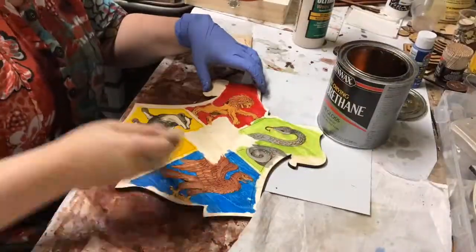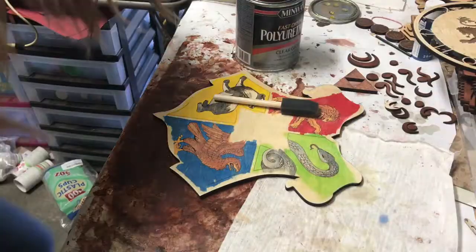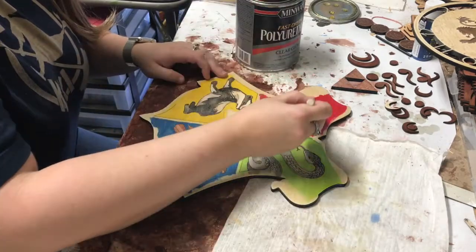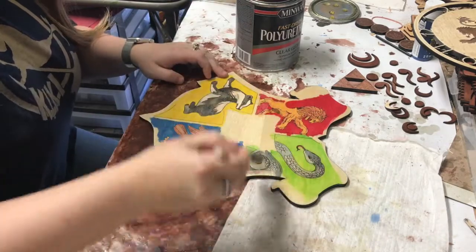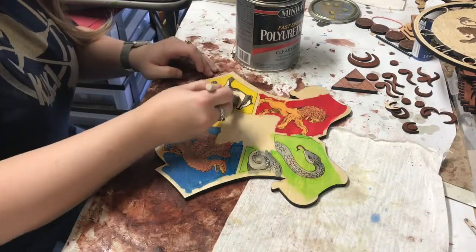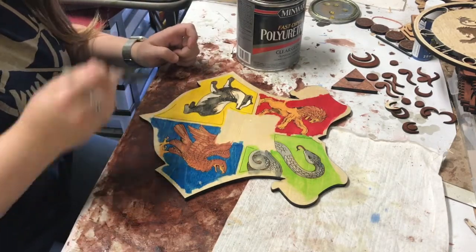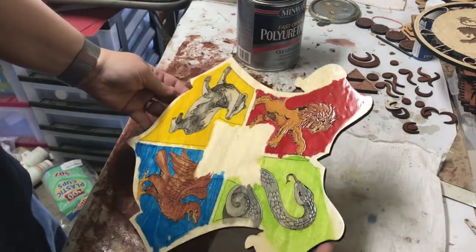After the paint is dried, I go in and polyurethane this part. The difference here is that it usually takes at least three, sometimes four coats of polyurethane to get the smoothness and shininess that I'm after. After the first coat I sand the whole thing — I think I used 600 grit sandpaper. The second coat I'm a lot slower and more cautious about getting it smooth, but it's still not smooth enough. I'll have to go in and sand it again and do another coat, then sand again and do another coat. You get the idea.